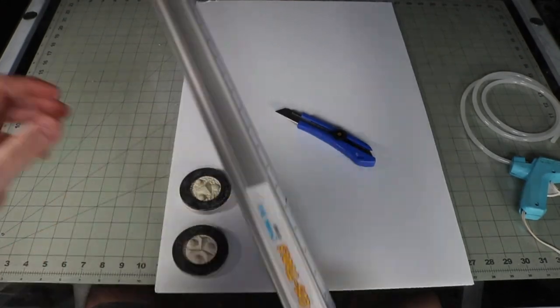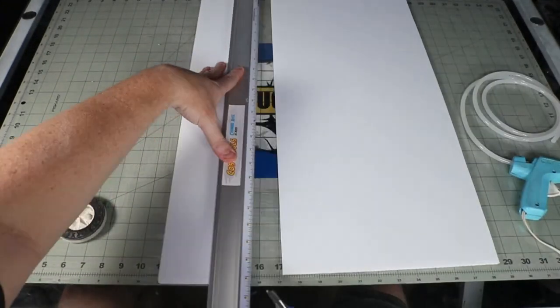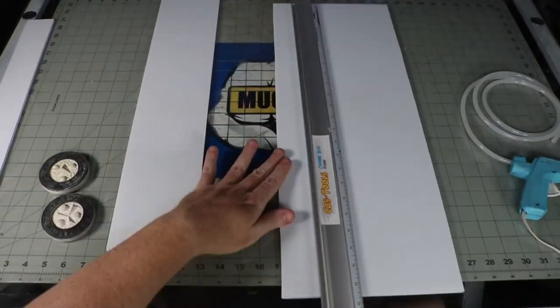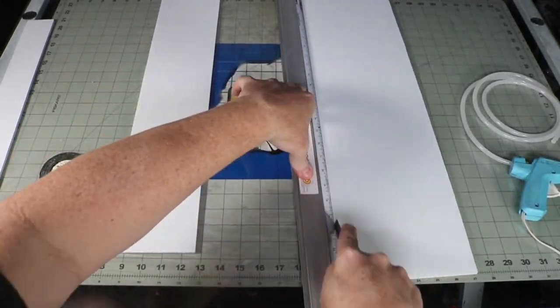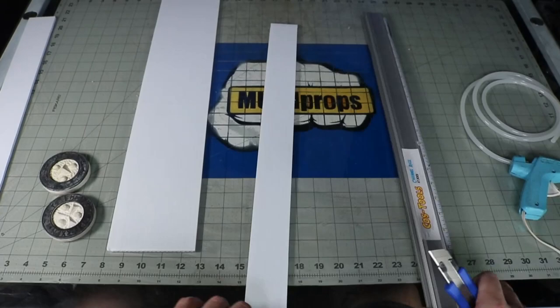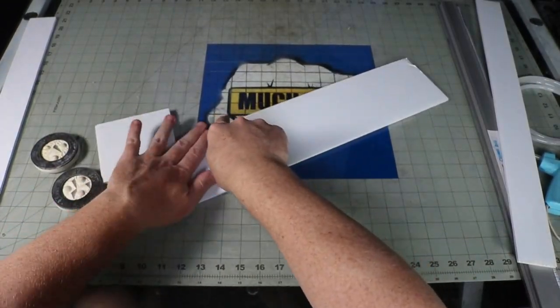I'm sure this is probably overkill, but I wasn't sure how well the three different materials would hold up with each other over time, so I decided that I was going to mold and cast them. I start this process by building a box to glue the medallion in to pour the mold on. I am using some corrugated plastic and hot glue to build my box.